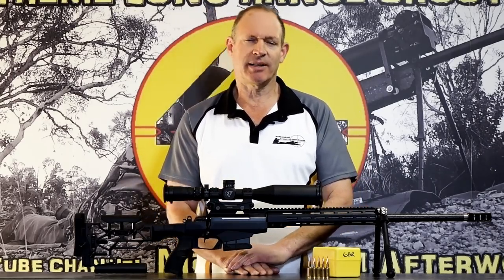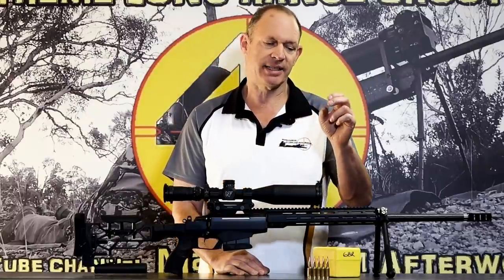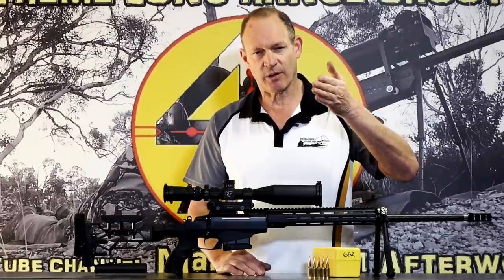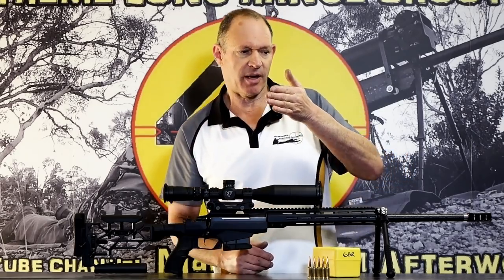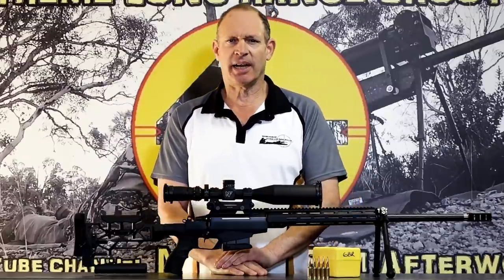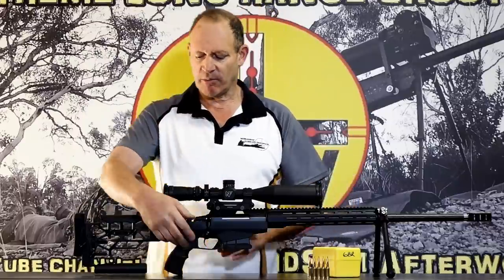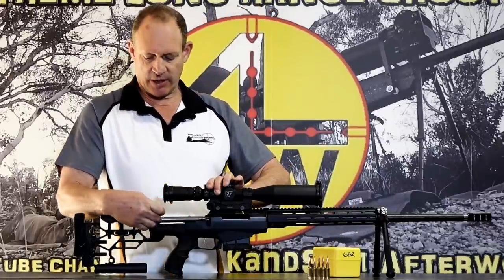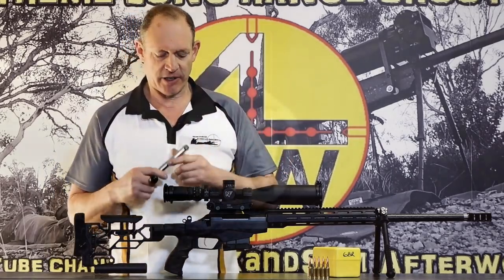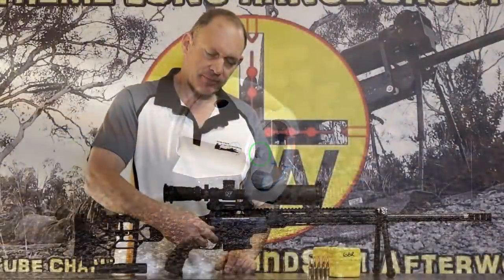My assumption, and what I said last week when I spoke about this rifle, was by looking at things. When I looked at the blown primers, I could see, in some of them, the blown part of the butt of the primer further forward. It looked too deep. And when I measured the firing pin protrusion, when you take your bolt out and drop it down till your firing pin protrudes, you can measure how far it's protruding from the bolt face. In this one, it was protruding 70 thou.